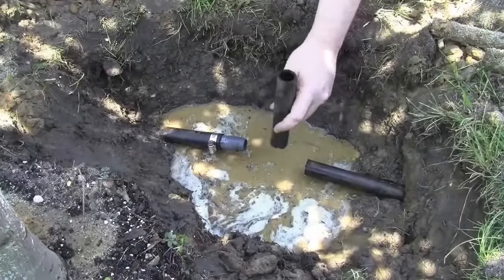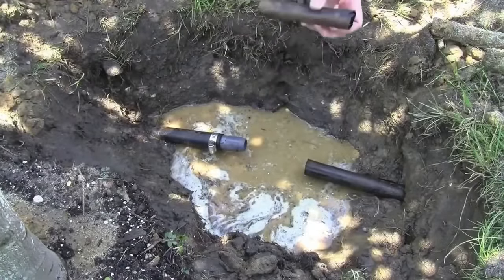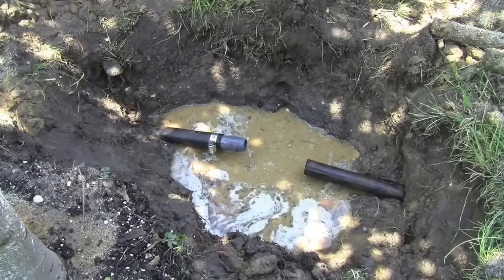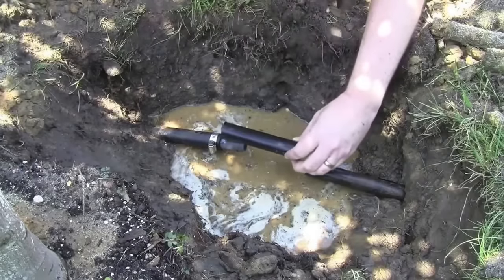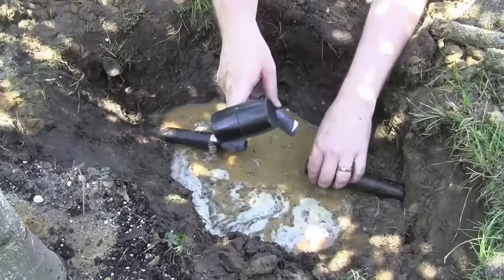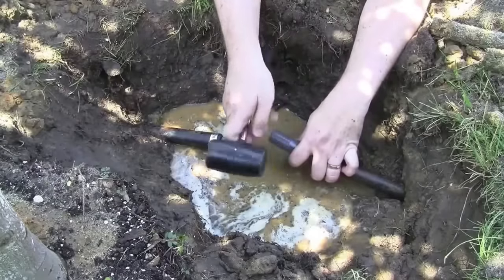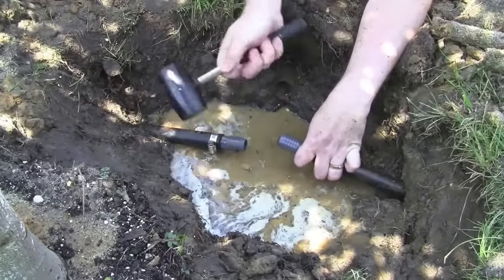Here's what happens if you make a larger cut. I had actually damaged my pipe a good three or four inch gash with a shovel. So instead, I cut out a section of pipe. Here's my old section, here's my new section of pipe. Same idea — you put couplings on both sides. Bang a coupling on one side, bang a coupling into the other side.